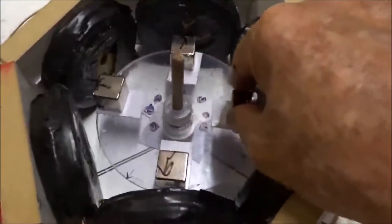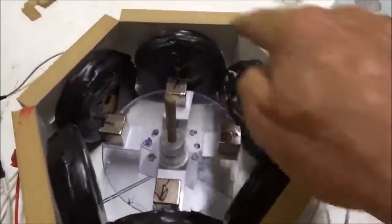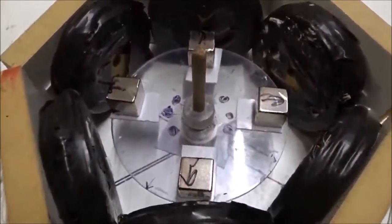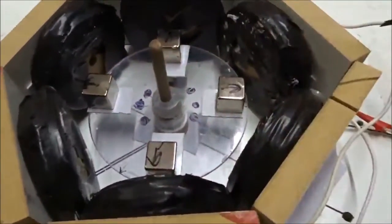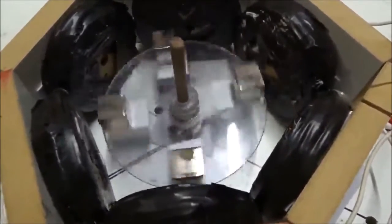We're going to have a little bit more fun. If you recall, with these six-wire coils wired up UVW UVW, our most tightly locked arrangement and smooth turning was NNNN — four magnets arranged in a 90-degree orientation. And when you put on the UVW power, it locks clockwise. So very good.